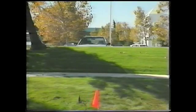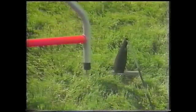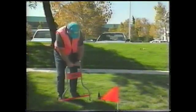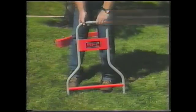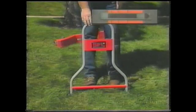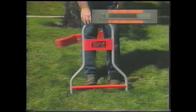The first step in fault locating is to synchronize the receiver to the transmitter signal. With the A-frame turned off, place the black spike of the A-frame next to the transmitter ground with the white spike in the direction of the cable. Push the A-frame into the soil. Turn the receiver on using the pressure sensitive switch. After the bar graph displays battery strength, the receiver will automatically lock itself onto the signal phase pattern generated at the ground rod, a pattern that will be duplicated at the fault. The flashing arrow will point in the direction of the fault. You have now synchronized the A-frame. To further confirm the existence of a fault, turn the A-frame around and push it into the ground again. The arrow will reverse itself on the display and again point in the direction of the fault. It no longer matters how the black and white spikes are oriented. As long as the A-frame is not turned off, it will always point toward the fault.